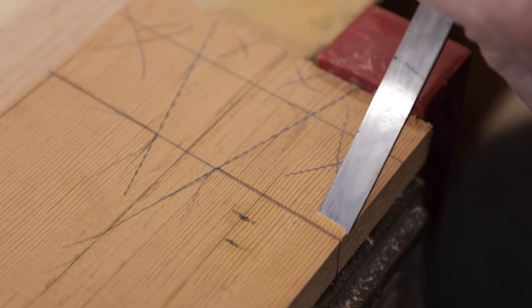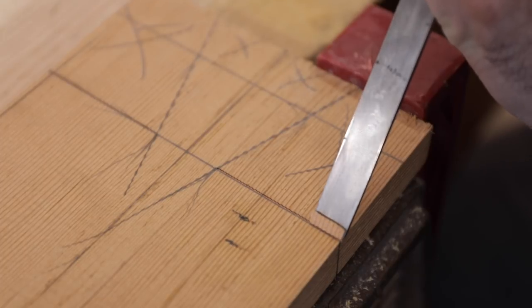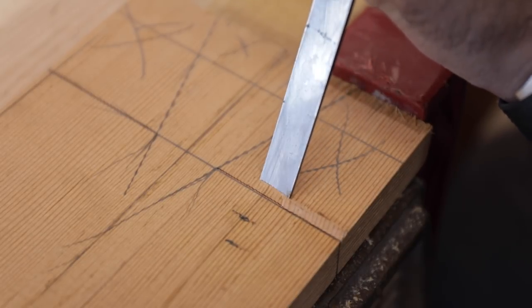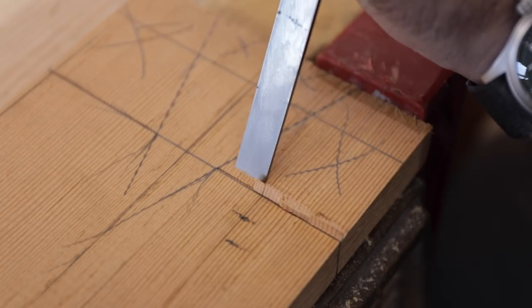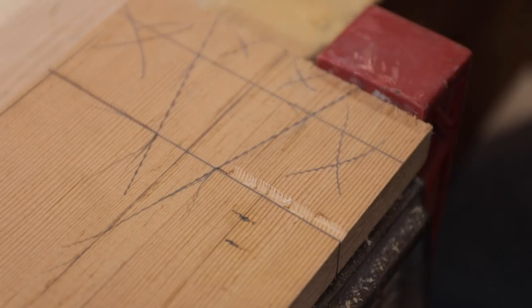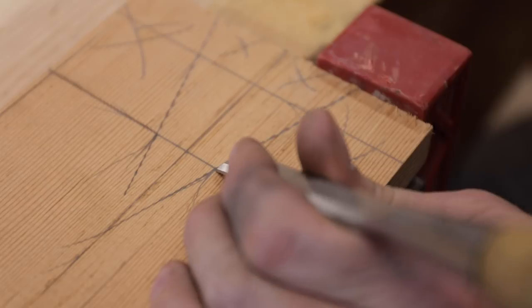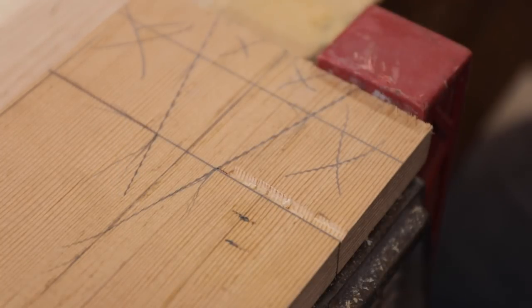This is my favorite part. Remember we cut that knife line — now we take our half-inch chisel and come in contact with that knife wall. You can feel the chisel and you'll know when to stop as soon as it hits up against that wall. CVG fir is so nice to work with. Now we're going to have to cut this too — it's kind of tricky because it's with the grain and crossing it at the same time, so I'll just put a little cut right there so I have a clean line.